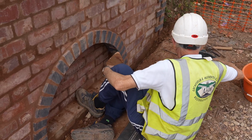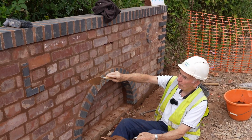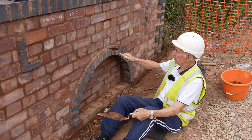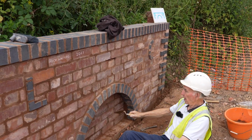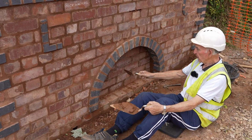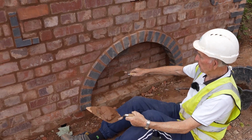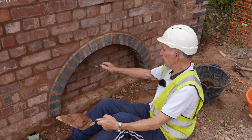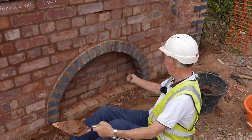Morning, Rick. Morning, Paul. As you can see from last time, I finished everything. Put the L for Litchfield and C for the canal, using a template and cutting the bricks ready. Then I built it up to form the same as the plan. And then it was time to remove the framework, the semicircle, to expose that wall I built before. It's a 9-inch wall, like a double wall. So I made sure that that was nicely smooth, ready for painting. It's got to be painted black, so it looks as if it's a tunnel, in theory.